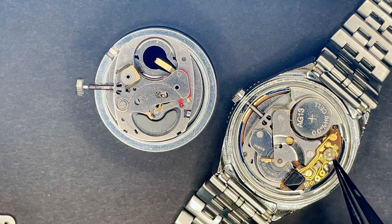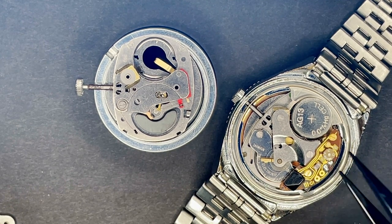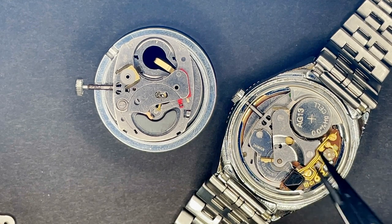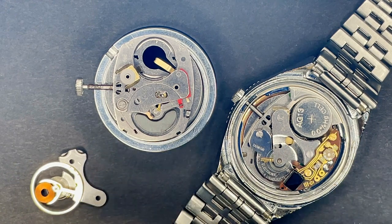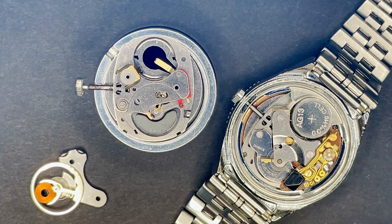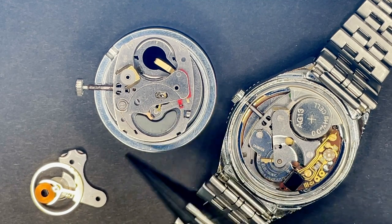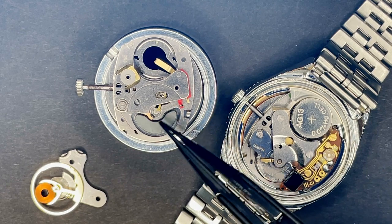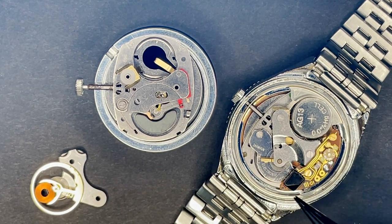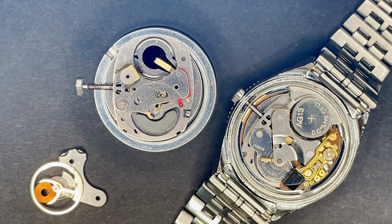On the circuit board there's a trimmer capacitor, and I believe another capacitor under here. This is a quartz oscillator. What this whole thing does — you can bypass this circuit and the watch will still run — but my understanding is that instead of the electromagnetic impulses being controlled strictly by the hairspring on the balance, the quartz oscillator controls it, making timekeeping more accurate. It also makes the movement more reliable, because the purely electronic contact tends to make sparks between the little pin and the wire, carbon builds up, and it can't make contact anymore. So the quartz regulates the impulses in sync with the oscillations of the hairspring and apparently reduces sparking.